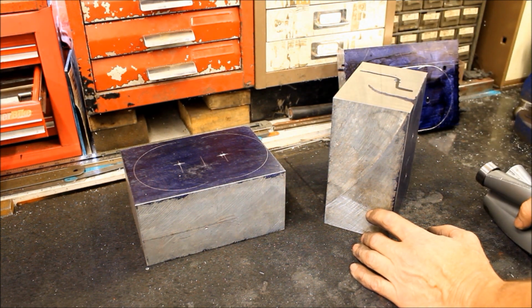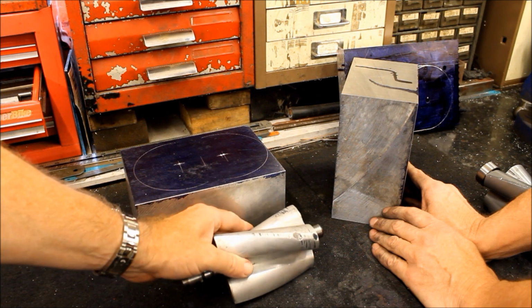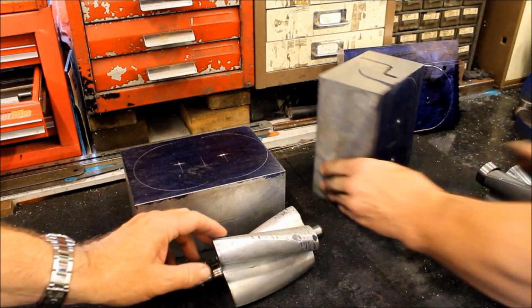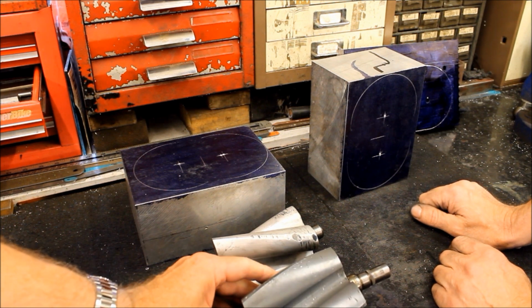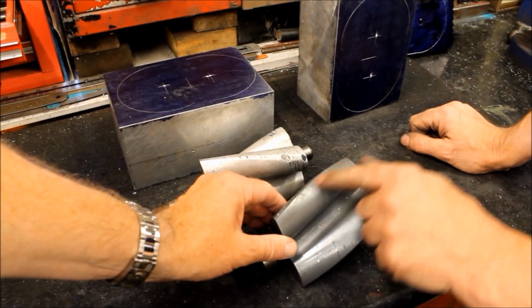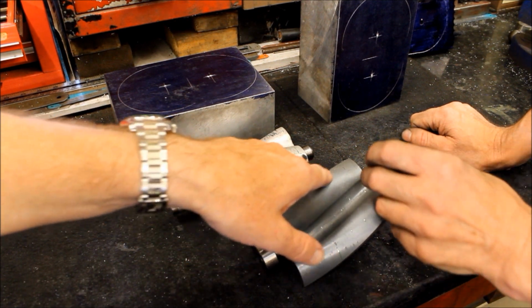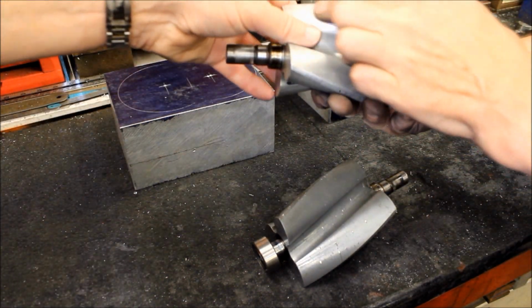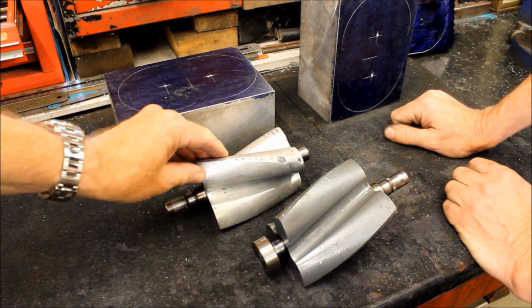Well, before you go on to that, here I've got in my hand a worn-out, damaged rotor. That's a damaged rotor out of an Eaton M45. And next to it, you've got one that's not damaged. We've got two. The only thing is you can pick these superchargers up very, very cheap, because you get a lot of Teflon off it. It's not very thick, a couple of thou thick, a Teflon coating. Well, that feels like it's been damaged. A paint stripper will bring it straight off.